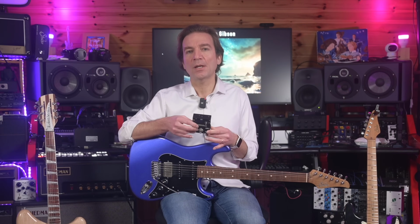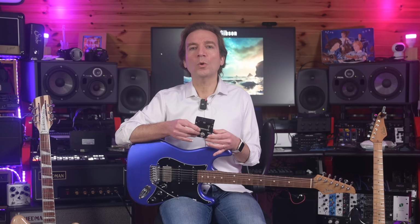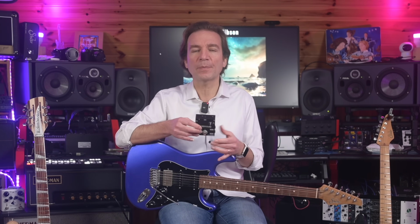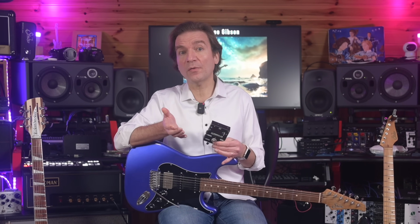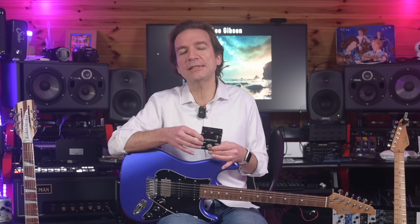Nonetheless, in a device like this, many things are going on. For sure there is an AD/DA conversion performed by the unit, then it has to properly manage the impedance of our guitar, etc. Therefore, if the converters in this pedal are not good or the analog circuits are bad, our tone may suffer. And the performance of the NAM profile we load in this device can be worse than the one of the same NAM profile but loaded in our computer.